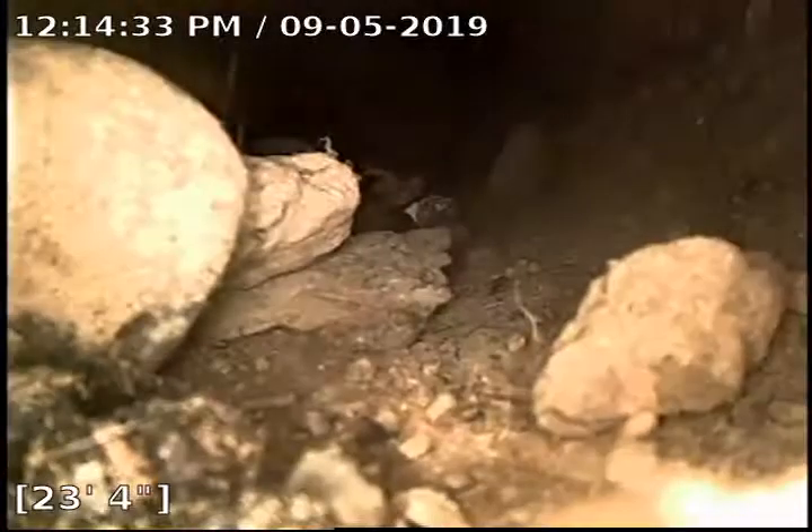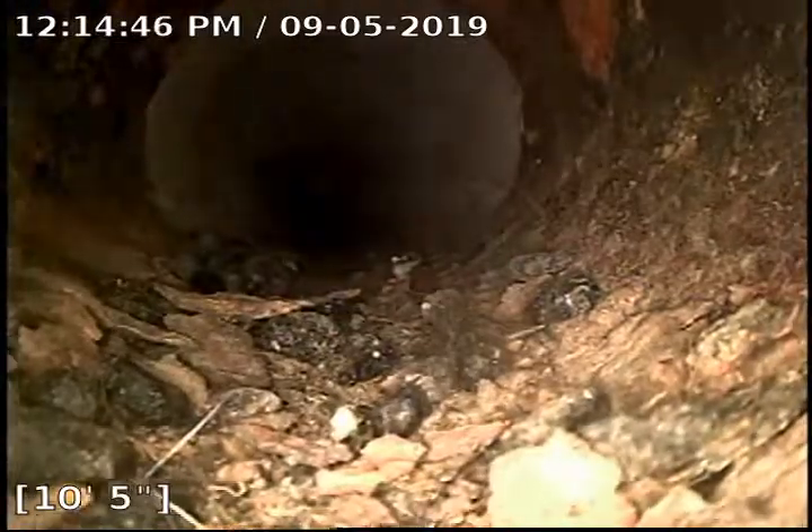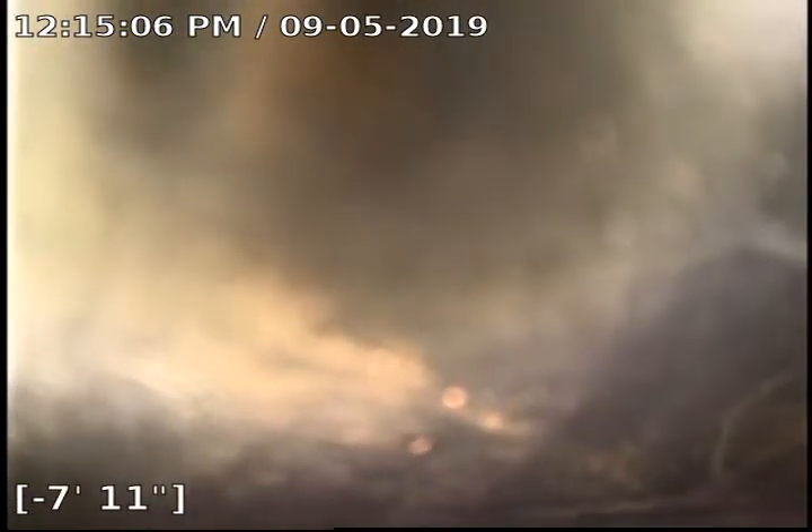I'm going to open it up here. Transitioning back to cast iron. That concludes the sewer scope — it is a failed sewer scope inspection due to the condition of the line. I recommend a repair done in the sidewalk area to remove the hole, and then jet the line from there to see if the existing portion of the sewer is in decent shape. Thank you.